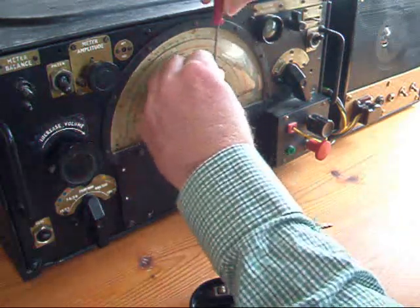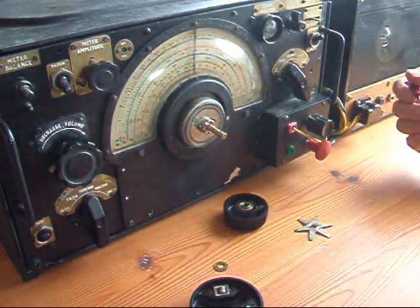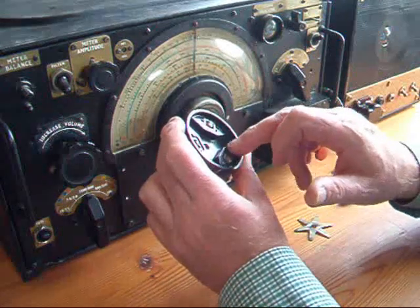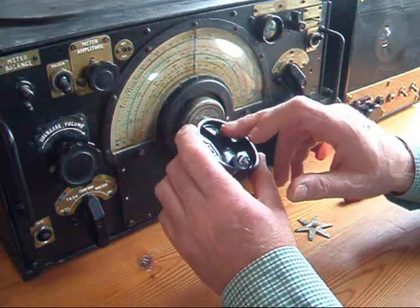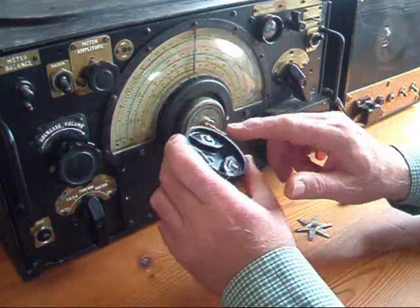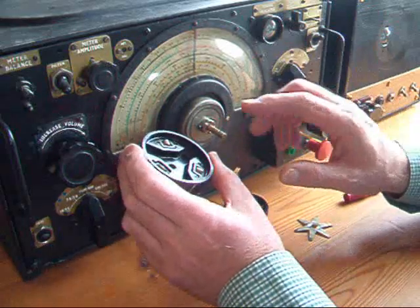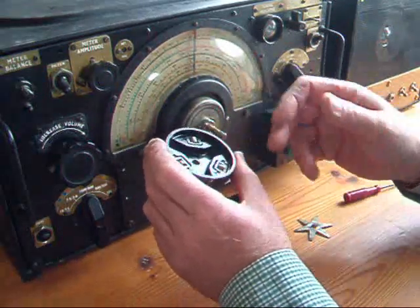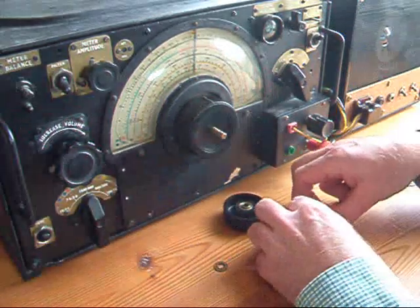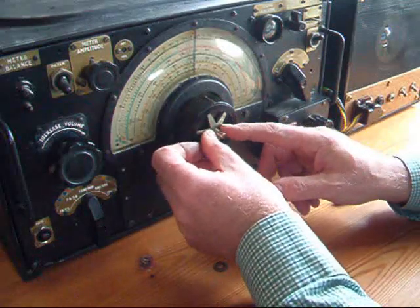It's important that there is a gap behind this stainless steel disc of approximately 1mm — that's 40 thou. Make sure that both of the drop screws are tight. Make sure that each of the rollers are clean and free from grit. They can have a little bit of oil on them — in fact I have oiled these and had this plate covered in oil and it doesn't make a lot of difference, but logic says keep the oil off the rollers. Then that goes on, and the star spring goes on.